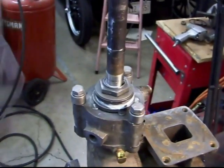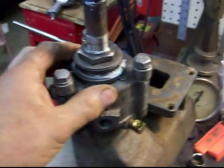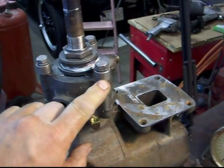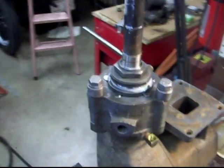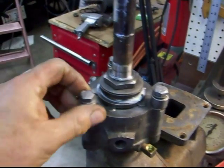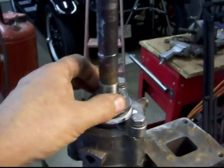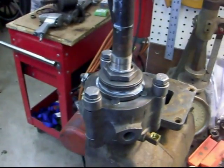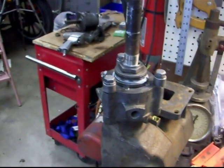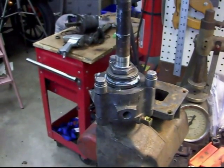I've got the shaft in. I've got the valve in place — I've got it oriented properly. I made sure that my bearings were centered, and then I use these spacers on my bolts because I don't have the special adapter that the book calls for — basically it's a plate which has the thickness of that housing. Anyway, I used these spacers with the bolts and snugged those up. Now I've got to go through the procedure of adjusting that — basically it's the control that directs the power steering fluid to the piston. That'll be the next step.